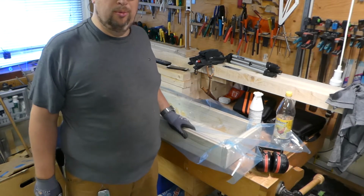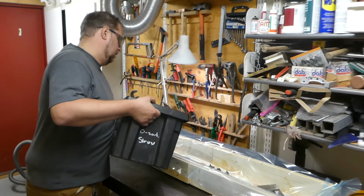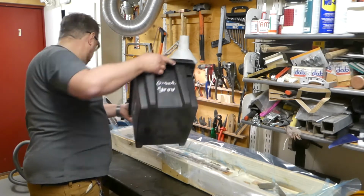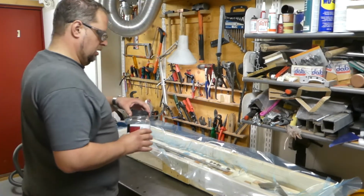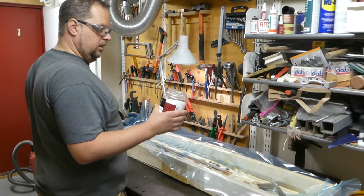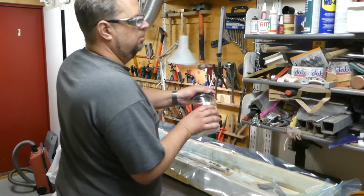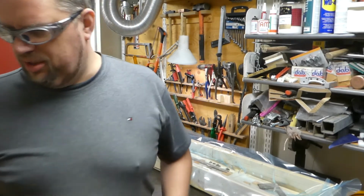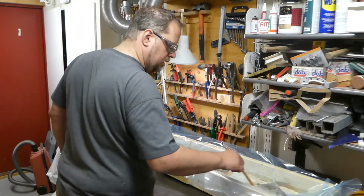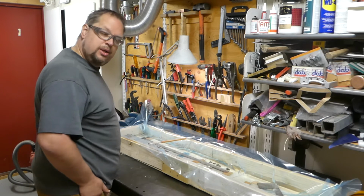Let's put the calipers in some bath. In the bucket here I have some hot tap water that makes it easier to dissolve the citric acid. Yeah, of course. And I'm gonna drop in a deciliter, 100 grams of citric acid. Maybe a little bit more. Just find something to stir it with, to help dissolve it. And I plan to leave it overnight.